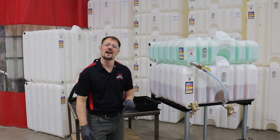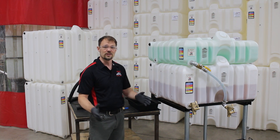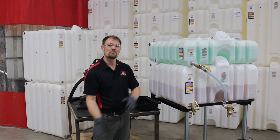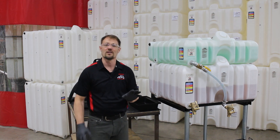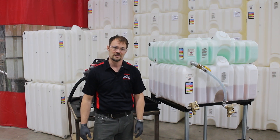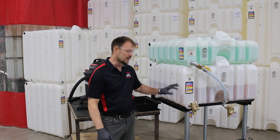So let's say you decide to add a side mount pump to an existing gravity feed system. Normally you'd have to drain the tank, add a ball valve, and then pump the fluid back into the original tank. Depending on what you have for a separate holding tank or transfer pump, that could be an all-day project — not to mention, you could be potentially introducing contamination into your fluid.